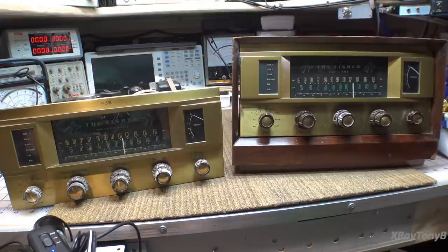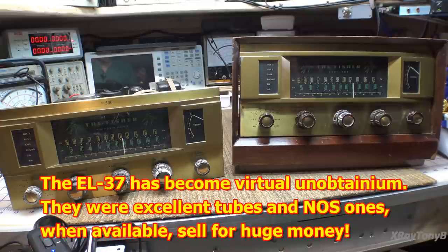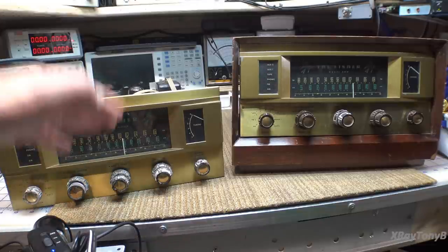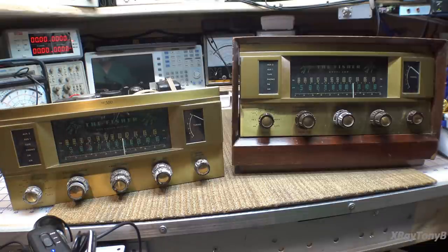What's so unique about them? Even though they're mono, they have a very good — extremely good — amplifier. They cover the full frequency spectrum, even beyond the audible range, and they're pretty flat. They use EL37 type tubes, 5881s, or 6L6s depending. It's rated at about 30 watts — very clean 30 watts — and they also mentioned it can do peaks up to 65 watts. These are really substantial amplifiers. They have a loudness contour, bass and treble controls, and were very carefully designed.